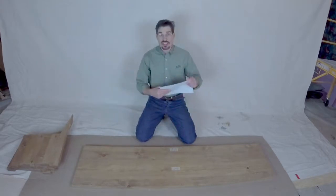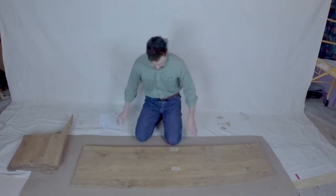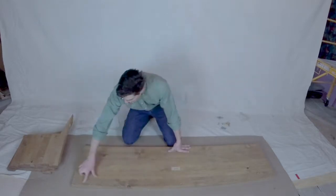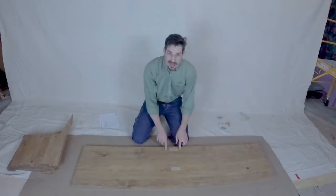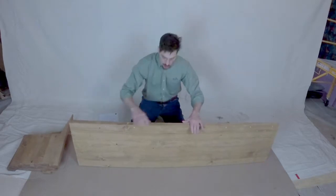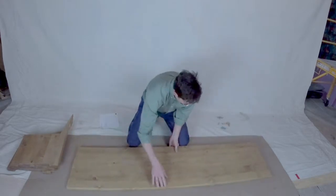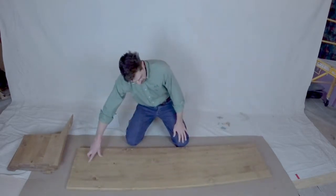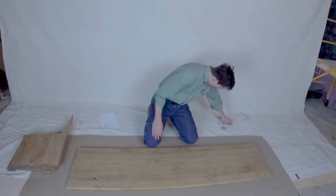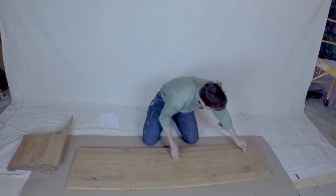We're going to grab our first leg — in this case it's the L leg. You'll see there's a set of holes in the back, and the label faces the front. We're going to tip the seat up with the front nose-down, then flip it on its back. We can see labels R, C, and L. We're going to take six of the wooden dowels and put them in the larger holes above and below each label.